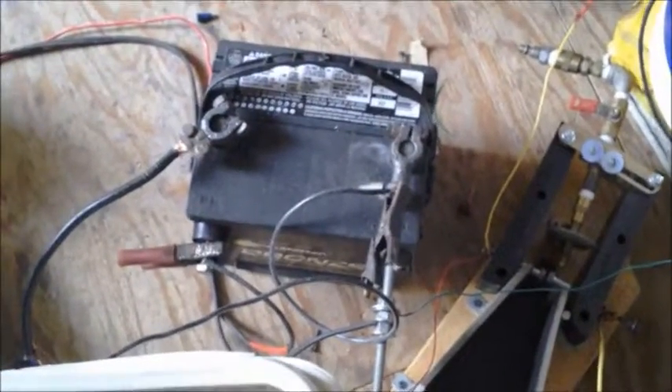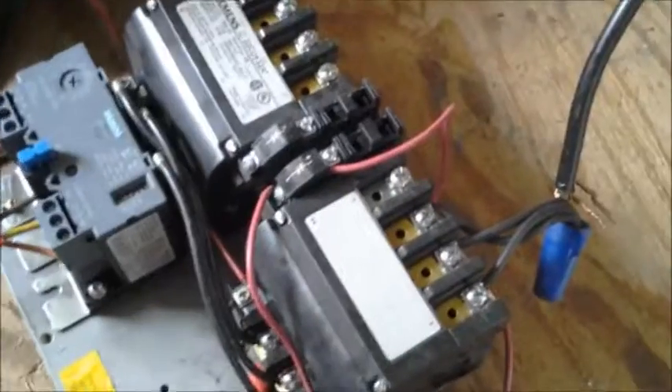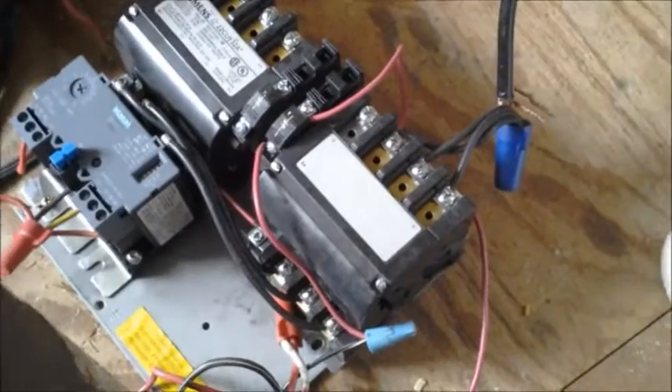Let me get to the meat of it. Here's the one car battery running all of this. That car battery used to have my rotary pulserator thing out there, which still works — goes through contacts. But I procured this on a job that was tearing it out: it's a reversing contactor that runs off 110. What I've done is connected the normally closed auxiliary contact to the coil that pilots the whole unit, which I've got three in parallel to accept the current from the battery. It just sits there and chatters back and forth, connecting and disconnecting itself like a buzzer concept.